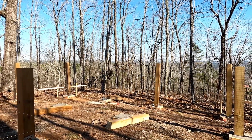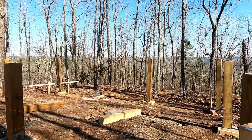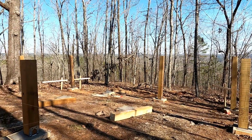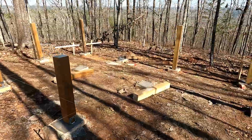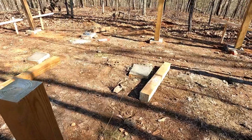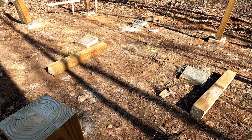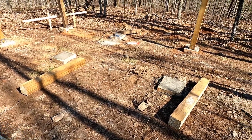And I might just wait until I screw them all into place before I start cutting anything, especially now that I know that those ones on the back are just way too long. And these two in the middle do not have their plates yet, because the concrete's still just a little bit soft. I don't want to drill a hole into it and put those anchors in there just yet. So let me do that math, and then we'll come back and see what we're going to do.